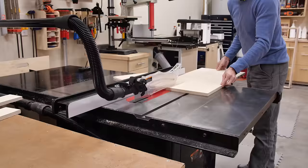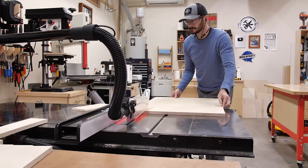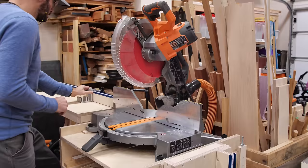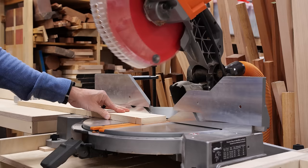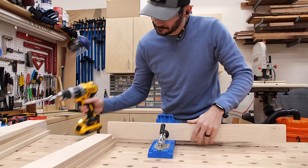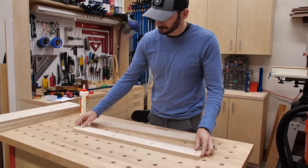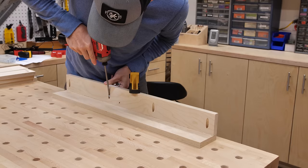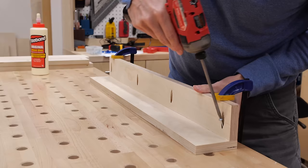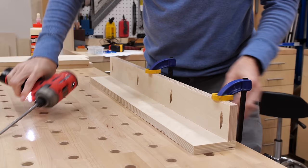Next I moved to the legs. I grabbed some more plywood offcuts and set up for the first cut. I ran four pieces at three and a half inches wide, then moved the fence in to two and three quarters of an inch for the next four pieces. The legs are made by joining one of each of these sizes together. I cut all the boards to the same length on my miter saw, then moved over to joinery. The two and three quarter inch parts are butted up on top of the wider ones and connected with pocket screws and glue to form a strong L-shaped leg that's three and a half inches on each side. I drilled the holes and spaced them out evenly across the board since they'll be visible when you look underneath the table. To secure the pieces together I used wood glue and screws and clamped the boards down on the end of the bench.